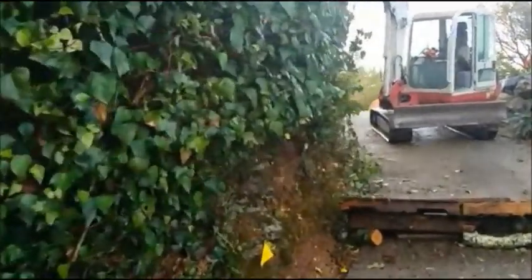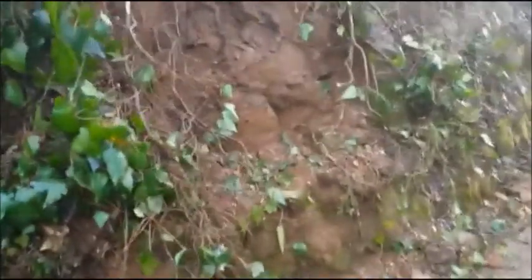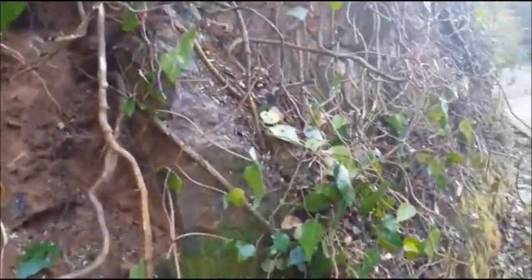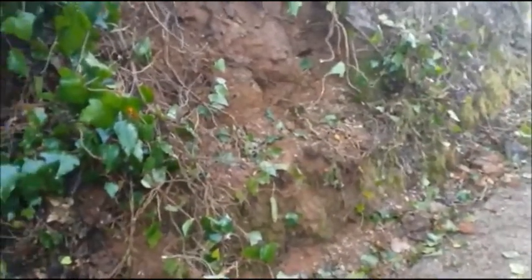And looking deeper into the situation, there's also a couple of practical elements. The first thing is that periodically the client experiences slides where a chunk of rock such as this will fall out to the driveway, and it puts some risk to cars, creates mud on the driveway, and so that also will be less common if the slope is tilted back.